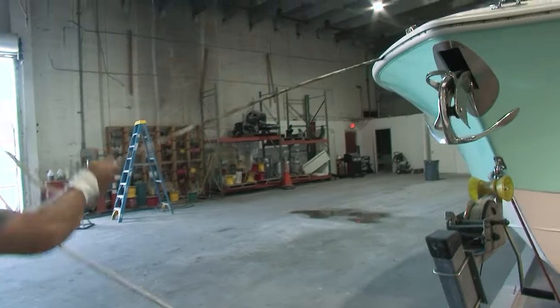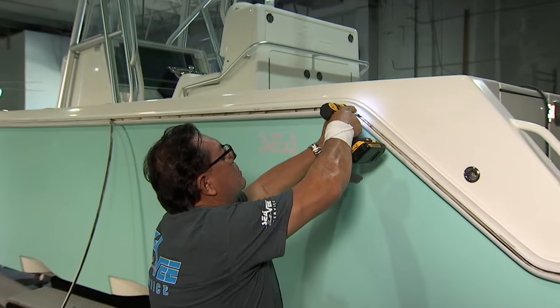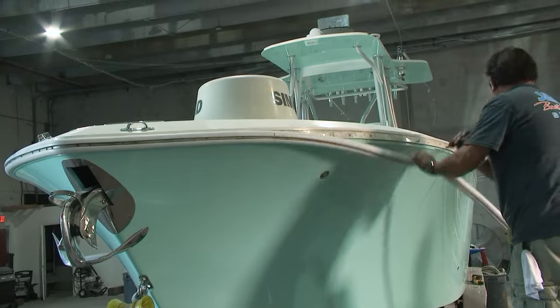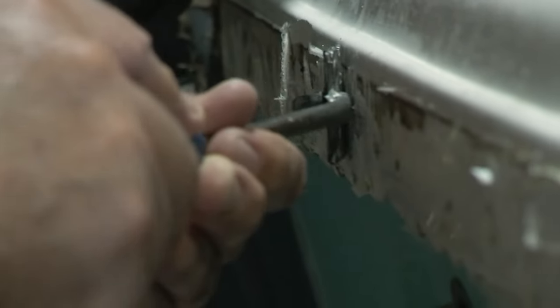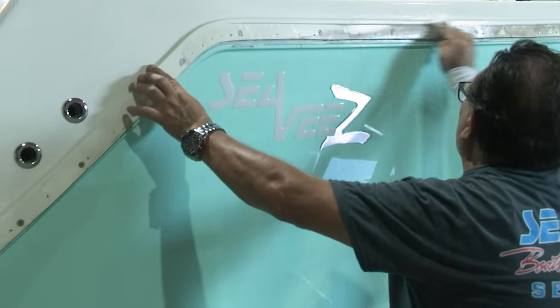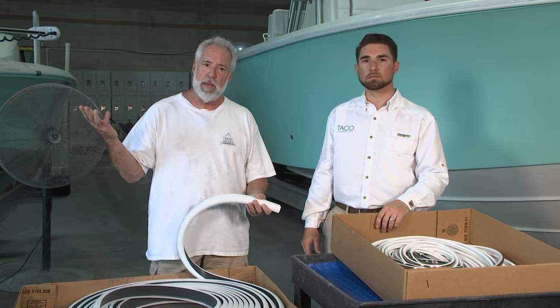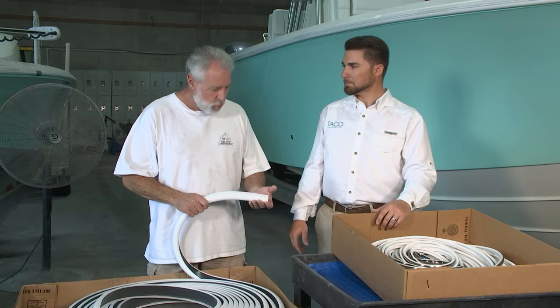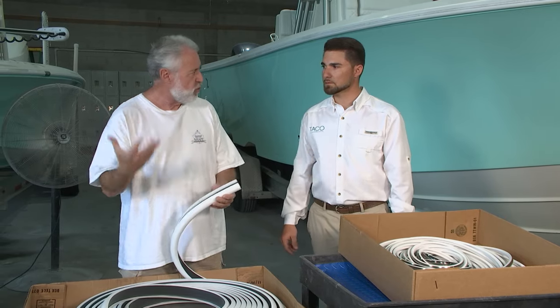What you're going to do is start off by taking out the insert and removing the screws — that's going to allow you to remove the rub rail from the boat. There's some adhesive and sealant left there. What would somebody use to clean that up before putting on the new rub rail? You're going to want to use acetone with a rag and just wipe off all that excess sealant residue to give you a nice clean surface. This is a brand new rub rail from Taco Marine, and who we have on the program is Daniel Avila, who is in outside sales for Taco Marine.